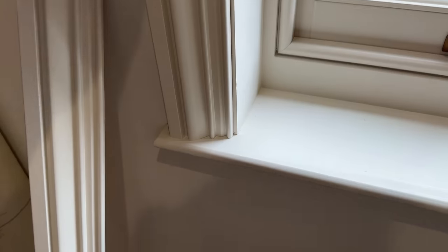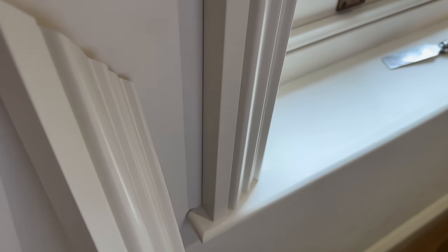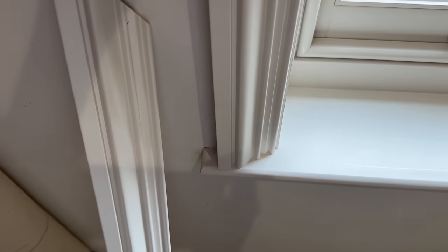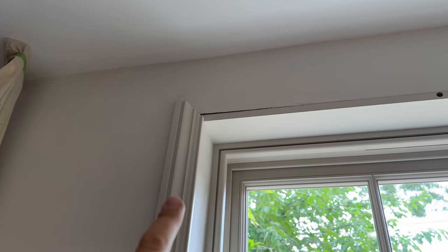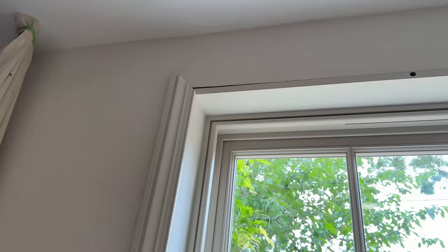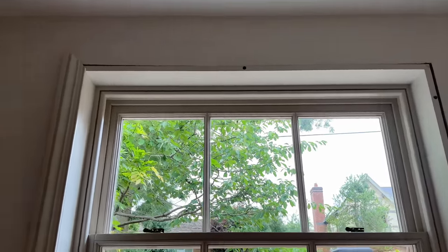And you want these to sit dead flat with the plane of the lining. So nice and sort of flat there. And like a perfect gap down the back of the architrave there. And if they don't sit flat, if they sit like slightly cranked like that, that's obviously an extreme version. But if you put them on, they sit like this as an individual architrave at the mitre. It affects how that mitre joint intersects. So to get a perfect mitre cut on your saw, to make it look perfect on the actual window, it has to be perfectly flat around that plane for them two pieces. So really important to get that part of the architrave sitting nicely before you try and make these mitres work.